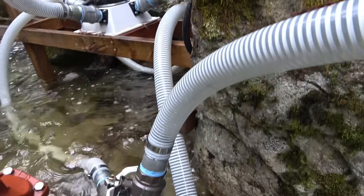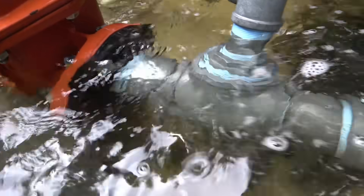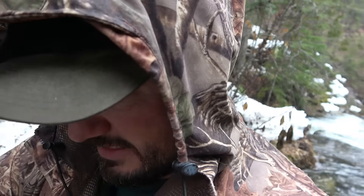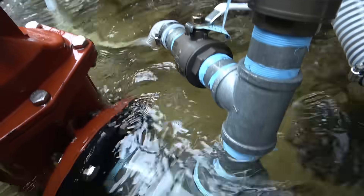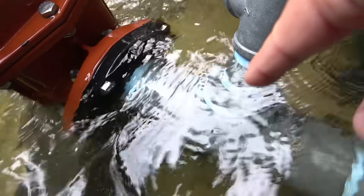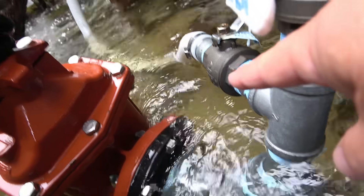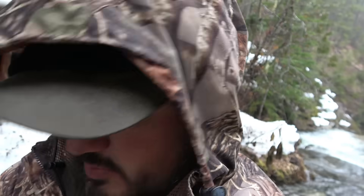Here's how we jammed it in last year. Look at all these sinful T's. The worst thing that we did was not even the T's and 90s. It's where we took a two inch and split it into two two-inches — that's no good. Down there it's four inch, and four inch comes up and then splits into a two inch that goes into a two inch and a two inch. That is a real bottleneck. Anyways, we're going to tear this thing down.